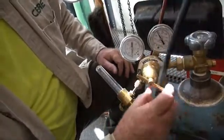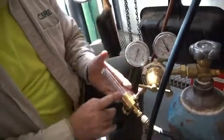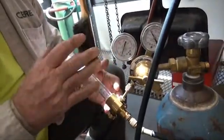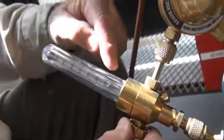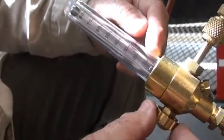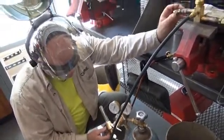Set your gauge. We only have it set for about 50 here. This is the working gauge for this valve — I can manage a very small pressure with it. Turn this and you'll see the black ball come up. That's 20 psi — way too much. In your reading it states you just need about three to five psi, or wherever you can feel it coming out of the valve. Nitrogen is very expensive, so we don't want to waste it.